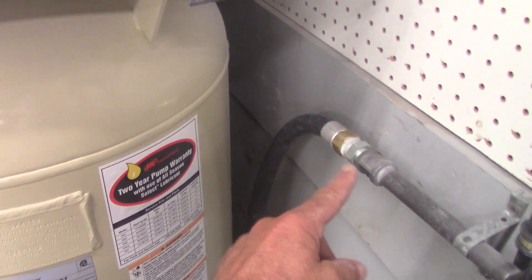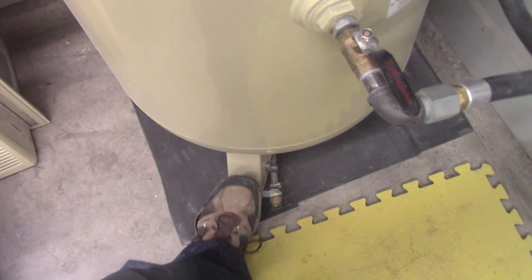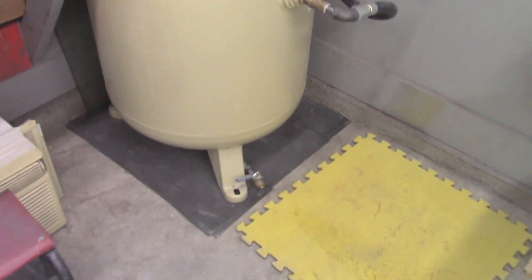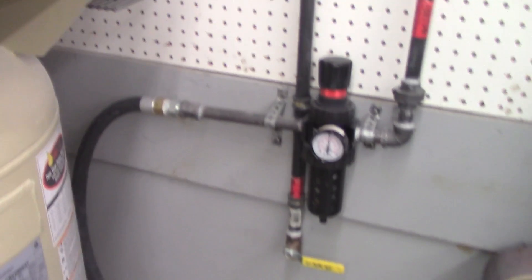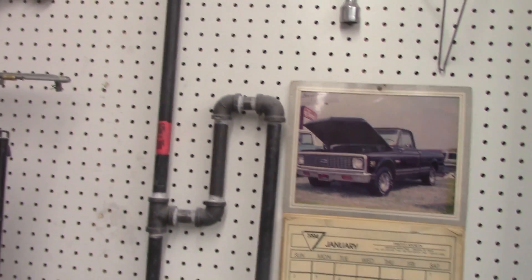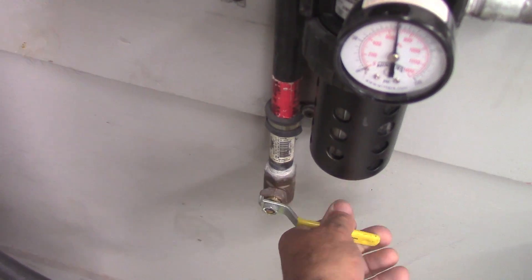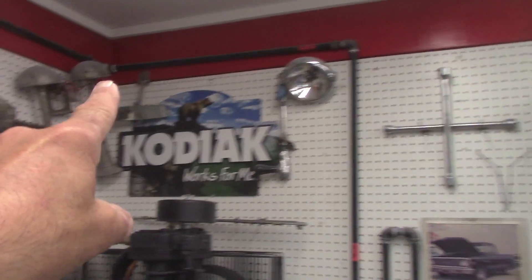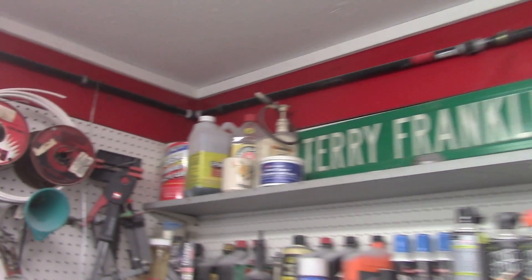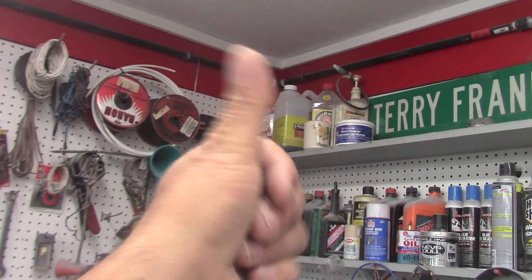Got my rubber hose run first right here. I got a drain on the bottom — got a little bit of water in there. Got that all strapped up real good. I can just barely hit that drain without damaging anything. Coming through, got my regulator and water separator there — of course it falls back down to the lowest point right on this side, coming all the way around to the highest point up there, got it draining back that way.